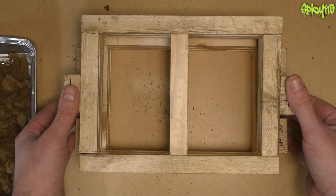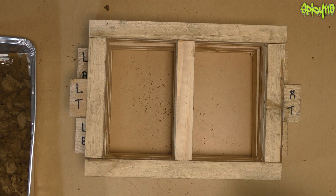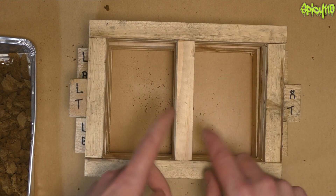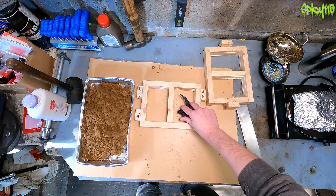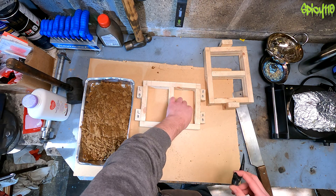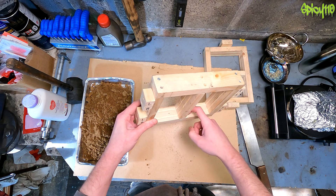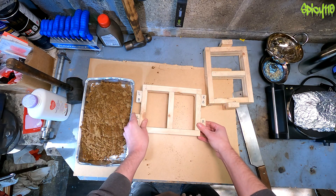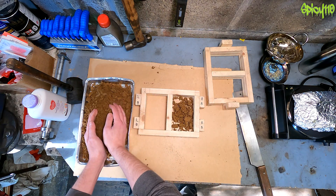This has two sections to it, because I thought it would be good to have two small sections — it was not, because I realized my clay wasn't enough to fill the whole thing. But the claw itself will fit very nicely in here. One of the things I did when I put this together was I used a Dremel to make a groove on the inside, because I've noticed lots of them have that — I think it's to give the sand something to key into. The first side is just fill it up and compact it down.